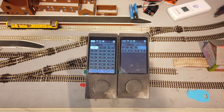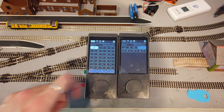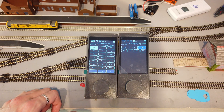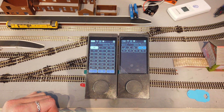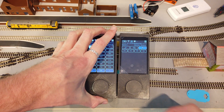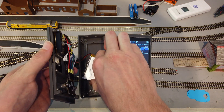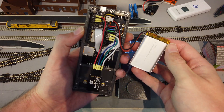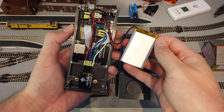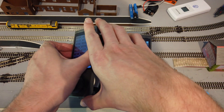There's still a bit more testing to do, and I'd like to try and make some custom icons for the buttons — if you've got any sound locos there'll be some by default, but you can always upload your own. Documentation and instructions are being worked on, trying to include all the pictures so you can hopefully make your own. It looks a little complicated but once you've got all the 3D printed parts, assembly should take roughly 30 minutes. You just need to do a bit of soldering.